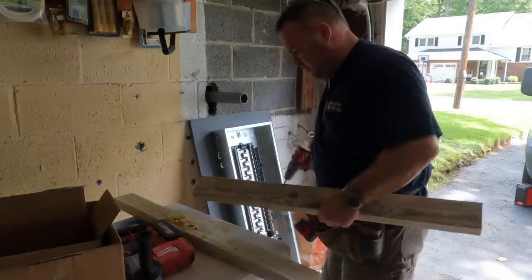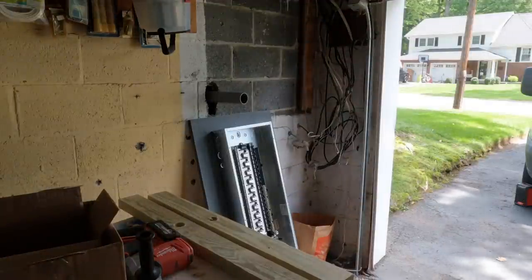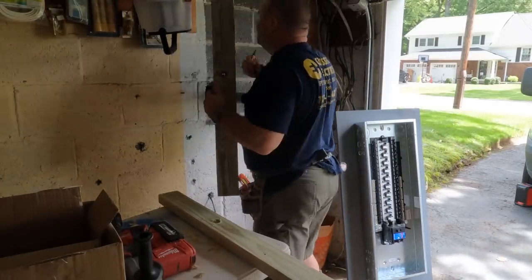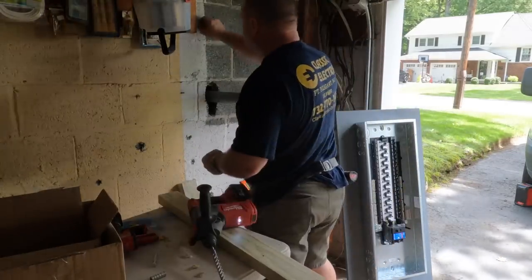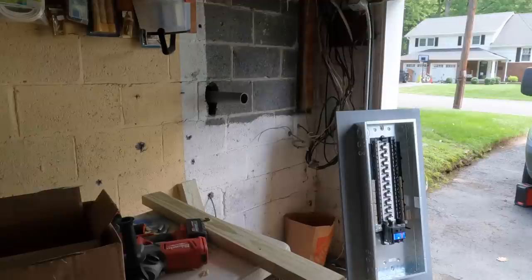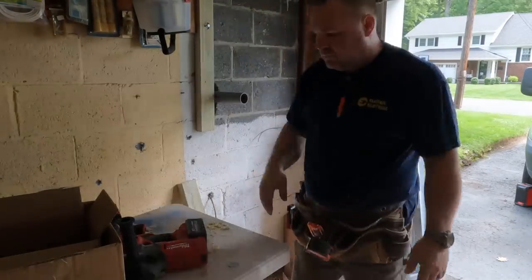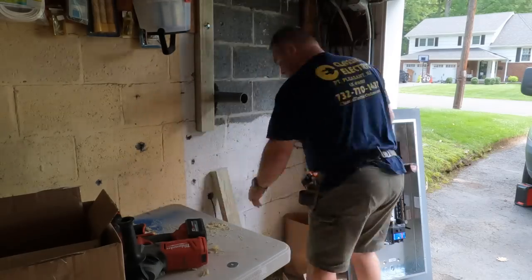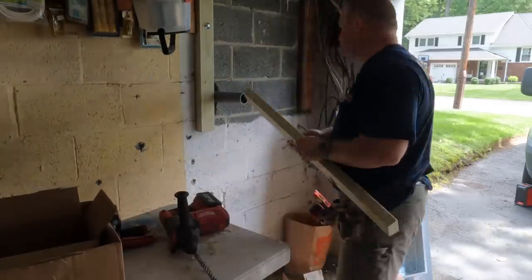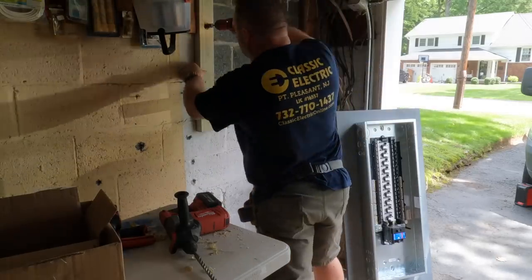On the inside, I'm using a paddle bit — inch and a half wide — making it big enough to bury my 3/8 lag screw and attach it to the shield, which is a metal anchor that goes inside the cinder block wall. I'm drilling a 5/8 hole just deep enough to fit this anchor, then putting the lag screw through the beam and tightening it down with a 9/16 ratchet bit. That makes it really, really tight to the wall. Once it's in there, it opens up inside the cinder block and it's impossible to get off the wall. I've used plastic anchors and Tapcon screws in the past, but Tapcon screws are awful in cinder block — if it's not poured concrete, those Tapcons really don't work well in this application.